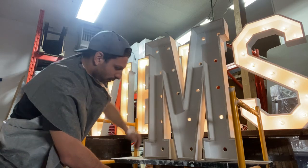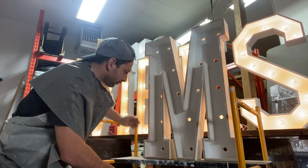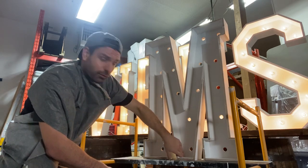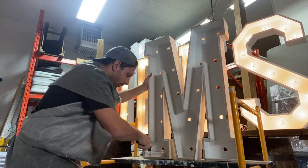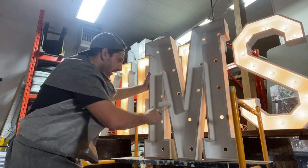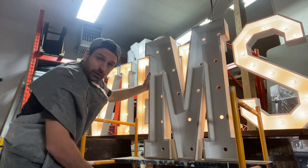Obviously you need to repaint at certain points, especially after mudding. My construction wasn't perfect so there were a lot of imperfections all over the place — I mudded, and we'll cover mudding in a separate video. Just roll the paint on to start out on the front, and then we're going to dip the end of the roller in there.